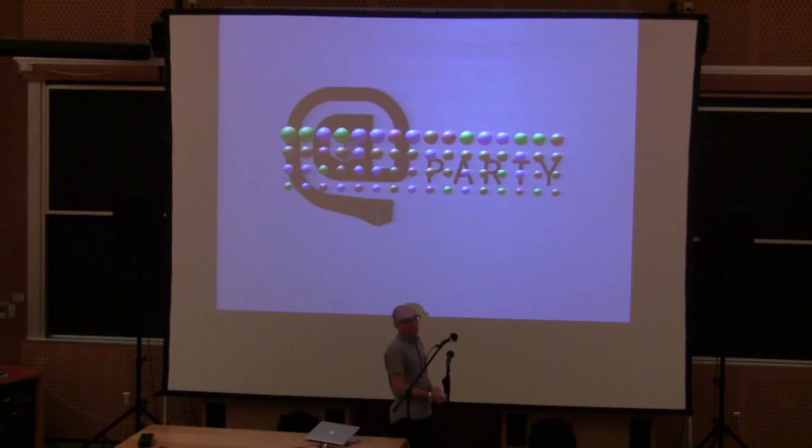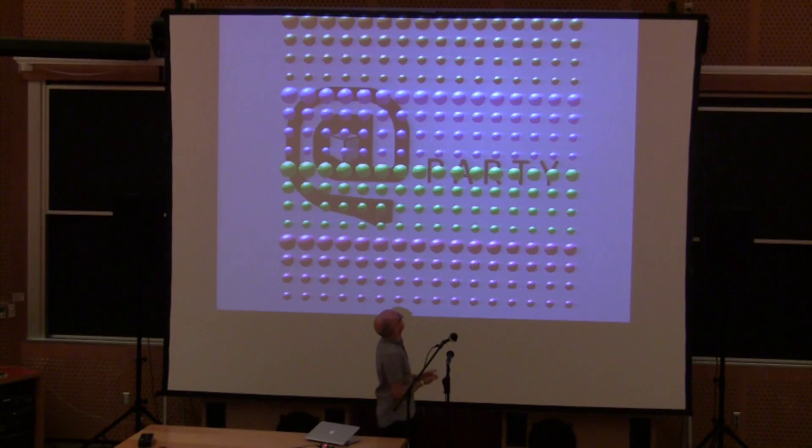That's the full set of sprites — all 256 going on screen at the same time. All the Arduino is doing is writing to a sprite table, writing XY coordinates to the screen. Even the MCU — an 8-bit, 16 megahertz CPU — has no trouble at all updating 1K of memory with XY coordinates, so it can move things around pretty fast.